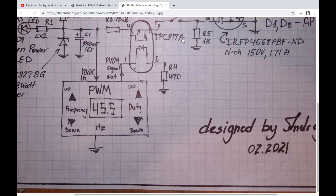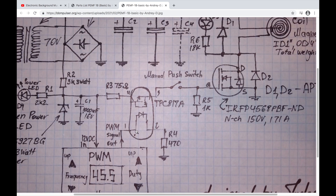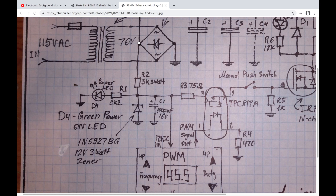This is a TPC 817 80-volt optocoupler. You feed the signal into the first leg; the second terminal connects to a quarter-watt 470-ohm resistor. The 70-volt AC from the transformer will end up as about 100 volts DC, so we have a 3-watt, 3-kilohm current-limiting resistor in that line.